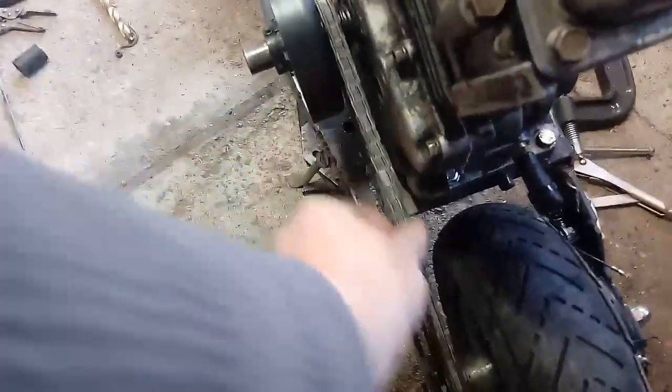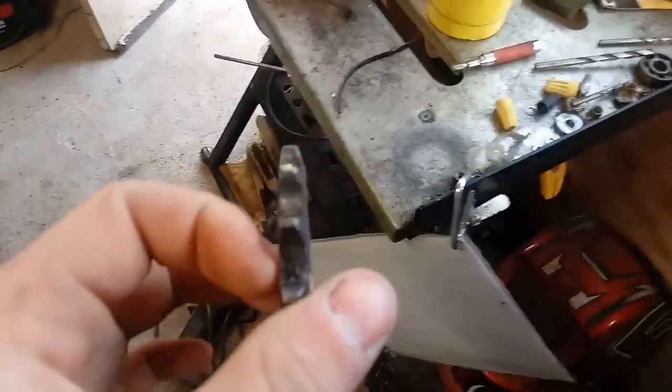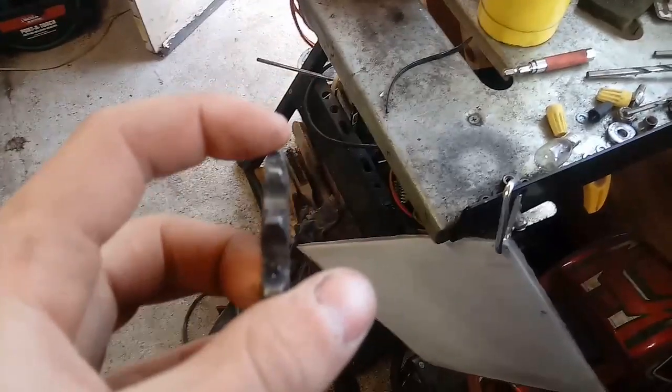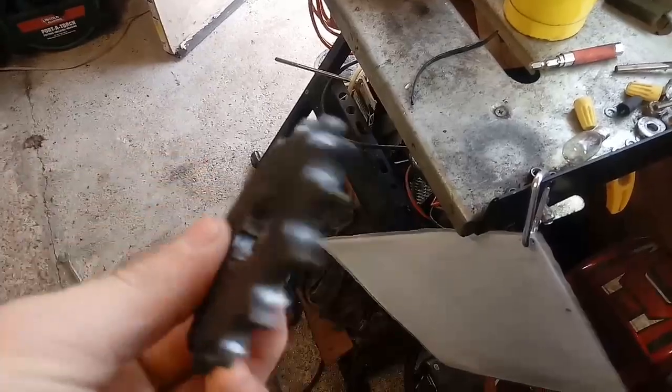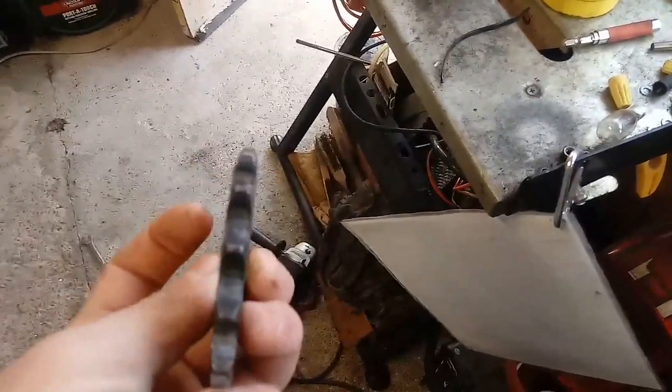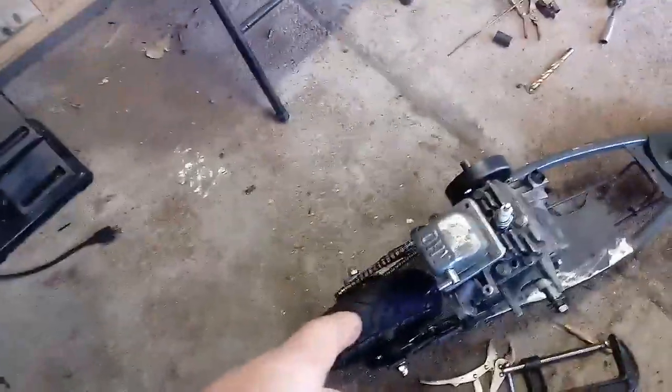And it does get hung up on the sprocket because there is no chamfer on this sprocket. Up here you can see there's that sprocket, and it has a chamfer on it. Most sprockets have this. Basically makes it look like that. Actually, the side opposing my fingertip direction is way too much, but you get the point. So I'm going to take that chain off again, make the chamfer on it, and then start it and see how it does.